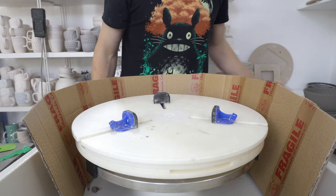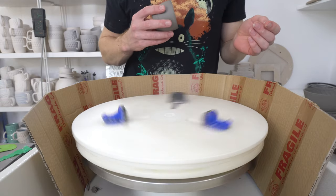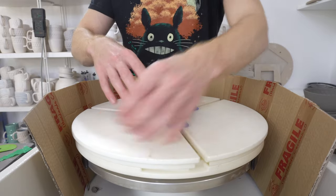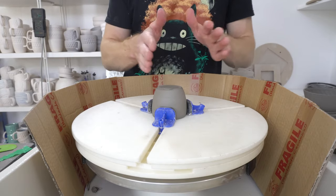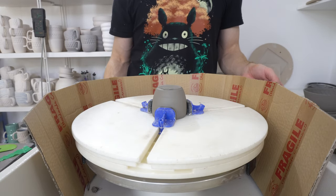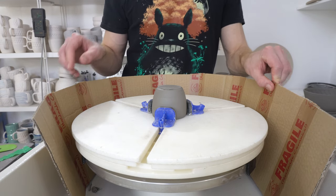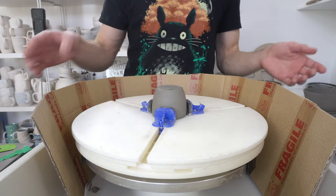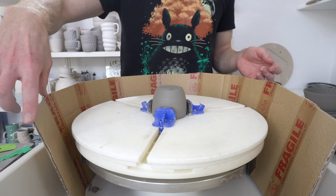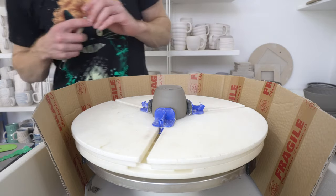This is the new guide in place and it's doing a good job of clearing the Giffen Grip so it won't rub as it turns, which was the main annoyance with the last one. As you can see, the kick-out is quite dramatic — you could have got away with less than a 1.5cm difference. So that was 13 at the top and 10 at the bottom; you could have done 12 at the top and 10 at the bottom for a less extreme angle. But this works.